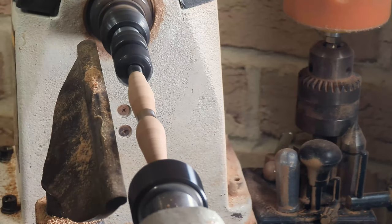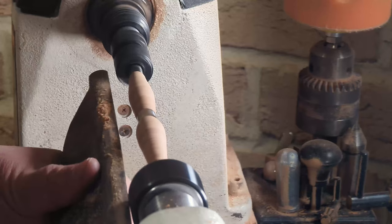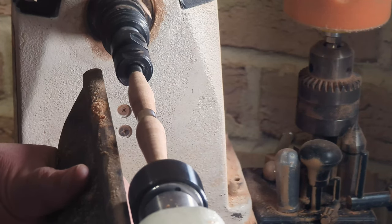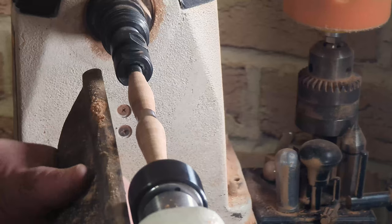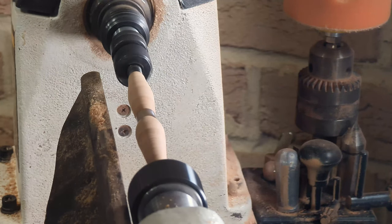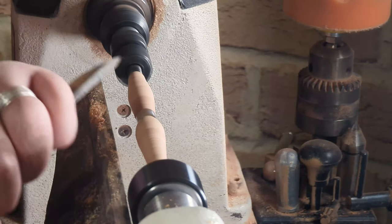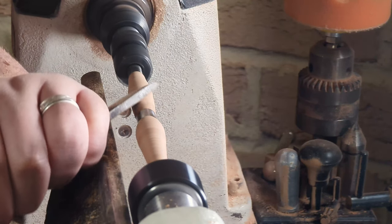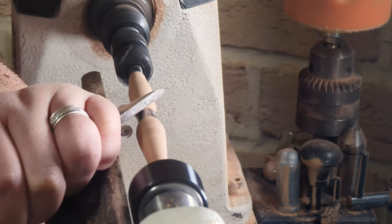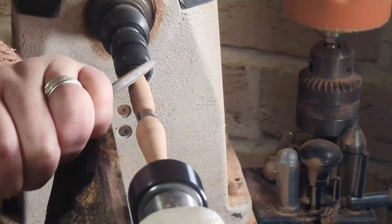Right now I'm just running my fingers over the ends to see how close I am to the bushings. You may notice I'm also using a mandrel again — this is a new mandrel, purely for pens like this, the ones that have the bushings that fit inside. I will try and do turning between centres. However, ones like the streamline where the 7mm barrels will only sit over and then the pieces of wood marry up to it, I will have to use a mandrel for those. I could move over to using a measurement system, but I don't want to do that — I'm a lazy turner and I'm honest about that.